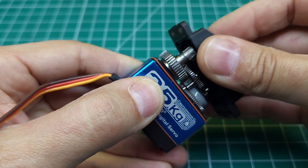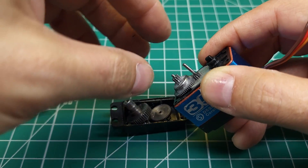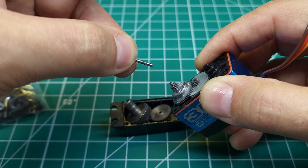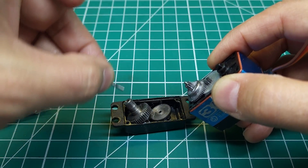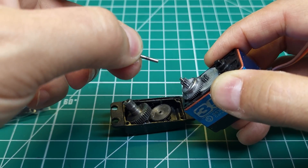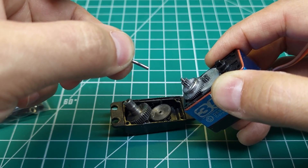Let's open up this Amazon 35kg servo and see what happened. It took me a minute to figure this one out — all the gears looked fine, but I did figure it out. This central shaft is actually bent. The truck put so much force on the top case that it pushed the case over, bending the central shaft. I can probably fix it, but this servo was killed by that truck.